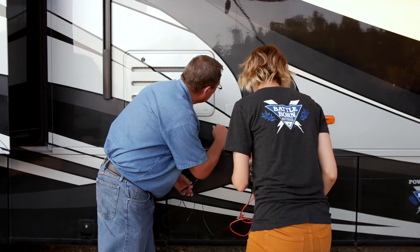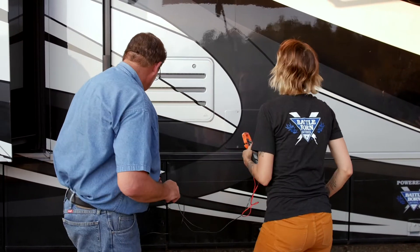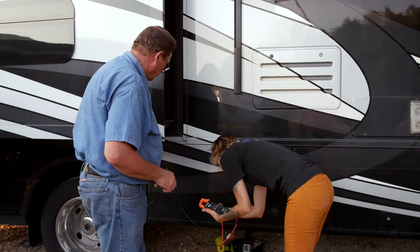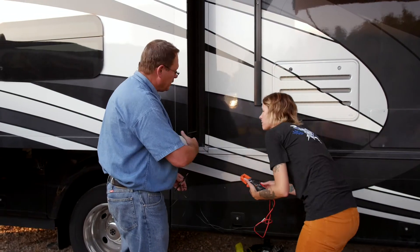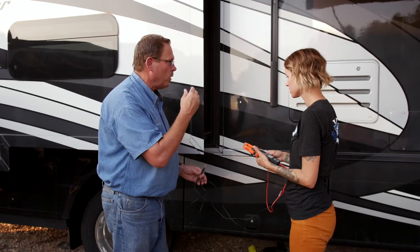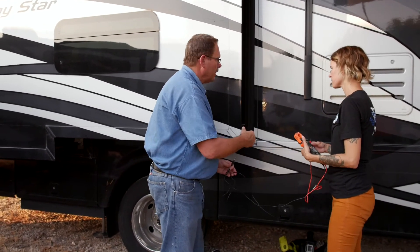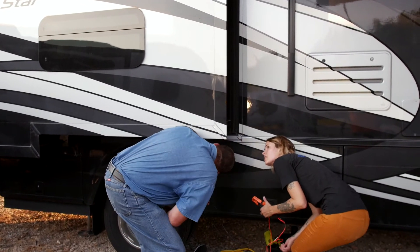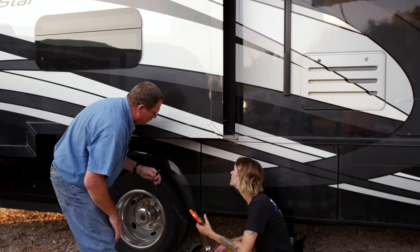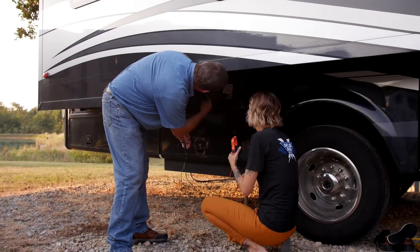Check door latches as we come along. Now here's a slide out — most slide outs run on rollers so they're almost isolated. We want to make sure we check the slide as well as the body. Find a place underneath with exposed metal that you can touch — part of the slide out mechanism, or the rack — to test this part of the slide.